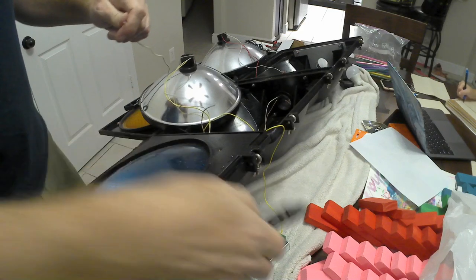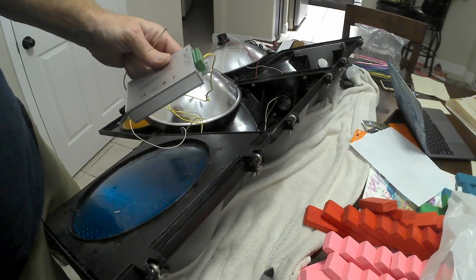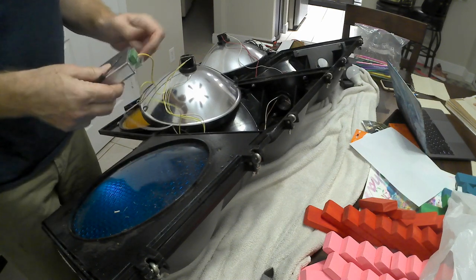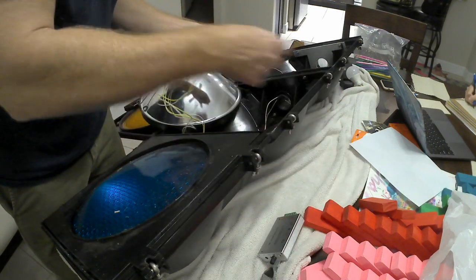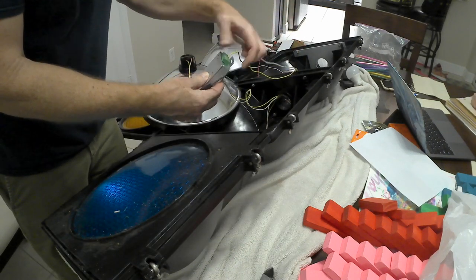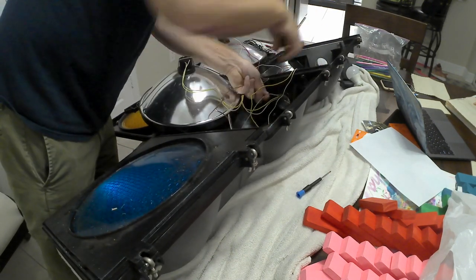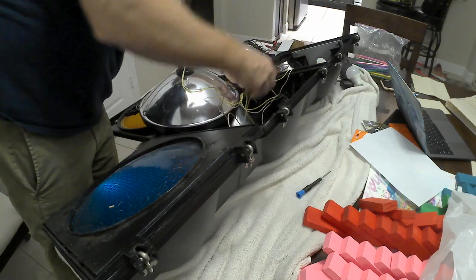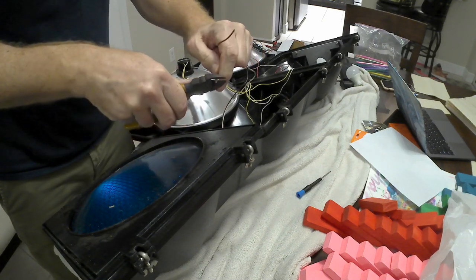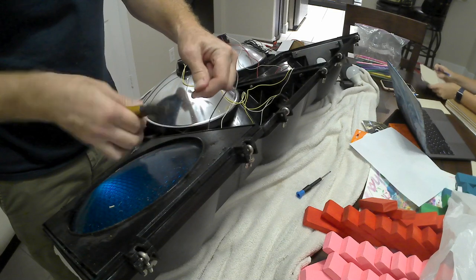This is where it's dawning on me that I need to feed the wires through the hole before I connect them to the screw clamp terminal block. So I'm going to back out the one connection I have, feed them all through to the top section so I know where the controller is, and use that as my jumping point for all the wiring. Again, connecting up the remaining two lights — positive is common on this type of controller, negative is the switch side — more stripping and putting into that screw clamp block.